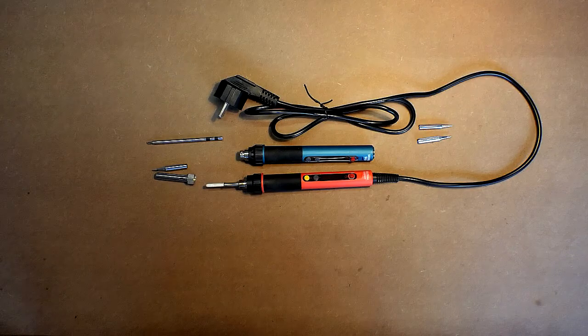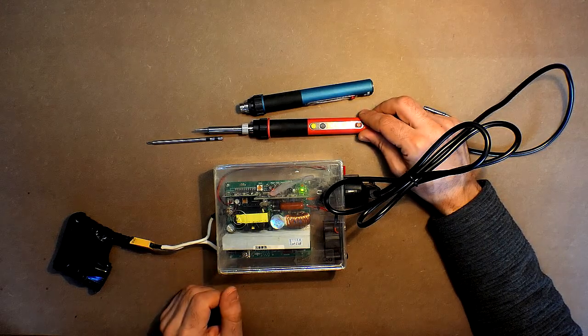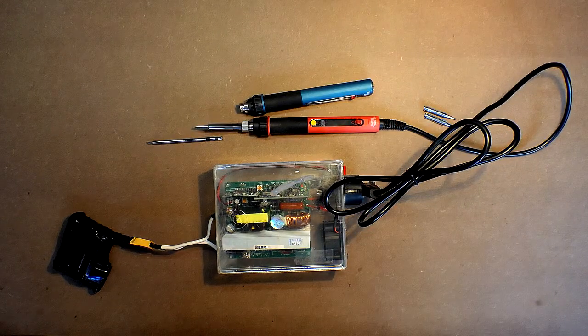And the second disadvantage. Despite the power consumption of this device amounting to only 60 watts, it consumes more than 100 watts within 2 seconds. So all the 100 watt and even 150 watt inverters I used refused to work together with this device and simply shut down. So for this mains version you should use a more powerful inverter, for example, a 300 watt one. It's too hard for this inverter with a weak battery, but it copes with the task. You can also see the review of this 300 watt pure sine wave inverter on my channel.